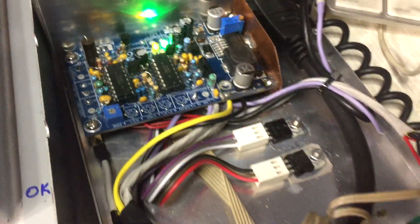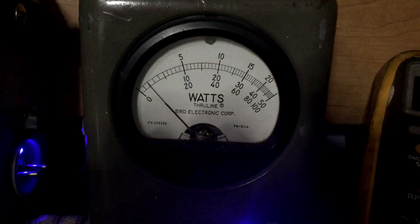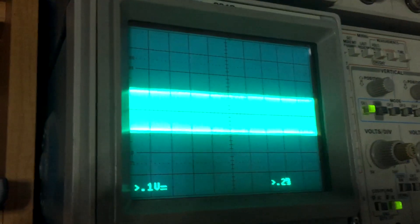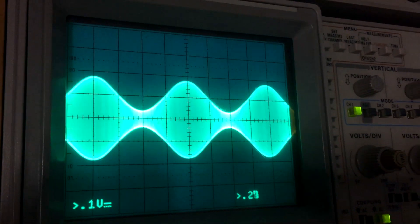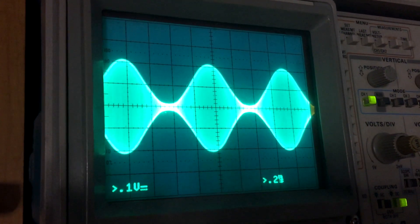Let's give it a little test run. We have our two watt dead key, we've set our reference on the oscilloscope, and we have the AC mod standalone connected and powered up on AM mode. Now we're going to start the tone and modulate the carrier. We have our output and we can see the fluctuations there on the carrier, and we're going to bring up the modulation control.